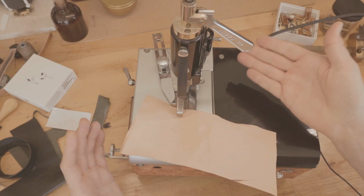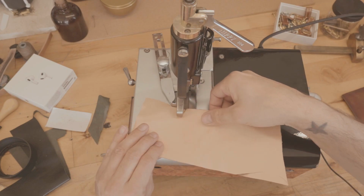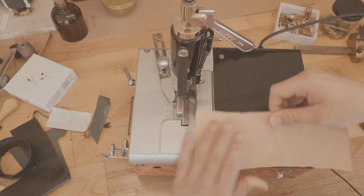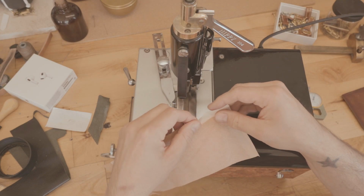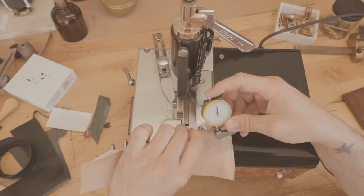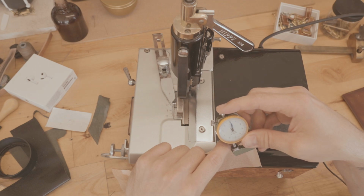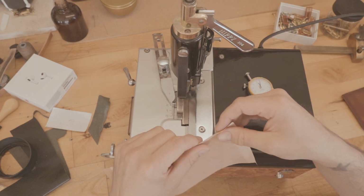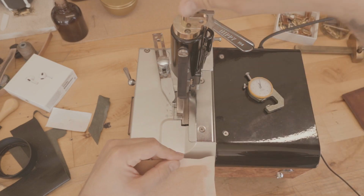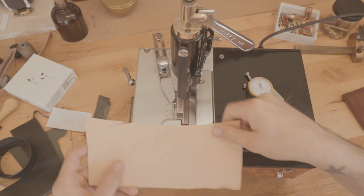You can see it wants, I have a really thin profile, so I would say help it pull it along so it doesn't go all the way. So this was just a test, seeing how thin I could get it. I don't think I can even measure that. That is 0.1, 0.8 millimeters. So this is just hair thin. This wouldn't be practical for anything. So I just go to switch up, just adjust the top screw, and try it again.